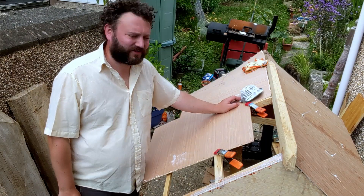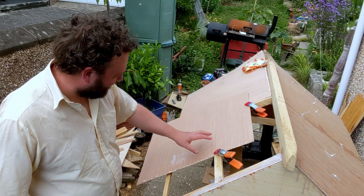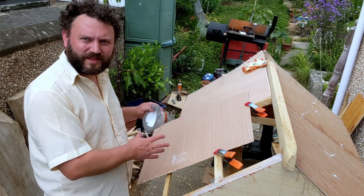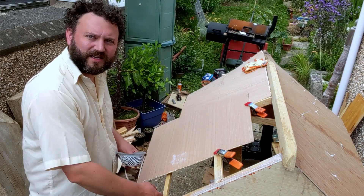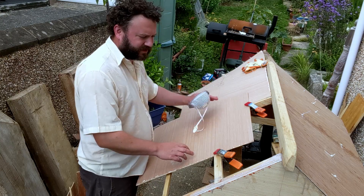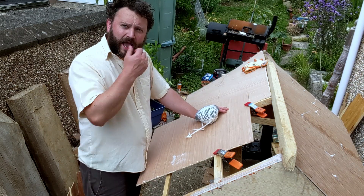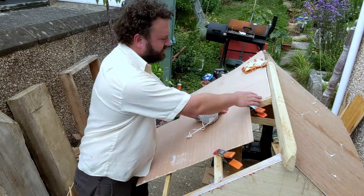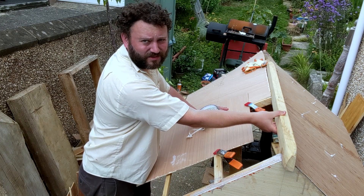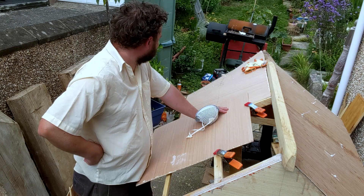It's super hot. After a not insignificant amount of faffing, we've got a second set of panels on the other side. The boat's been turned around so I can work on this side more easily. I've still got the lower or upper sections of the boat to do. I'm going to clean up the edges of this panel and then epoxy it in place. It's been brought to my attention — and I kind of knew this already — that this point here is going to be a bit too weak, so I'm going to be inserting a floor from the inside with epoxy just to strengthen that portion of the hull.